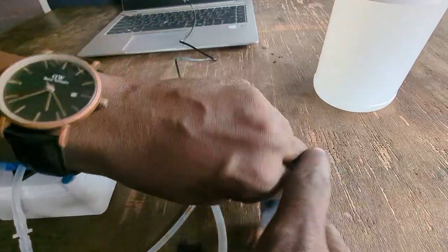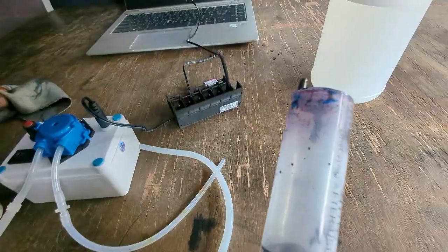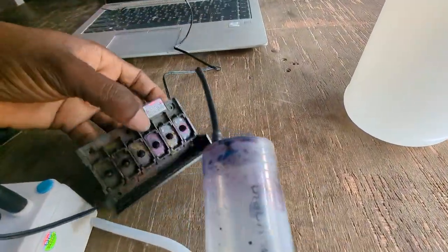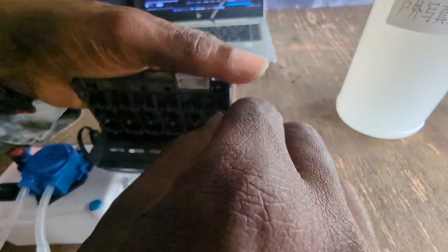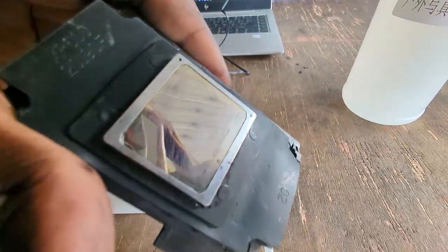Or at best you would have tried to push out ink like that. By that effort I was making — let me open this up a little more — you'll see that the printer head begins to respond because you are pushing ink into the cavities of the XP600 printer head. Watch what happens to the face of the printer head when I begin to push.